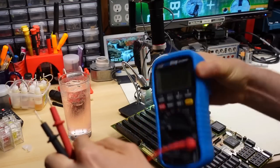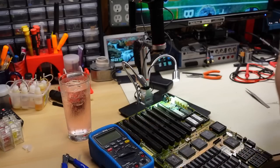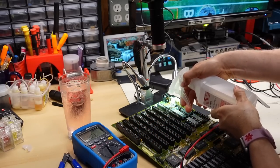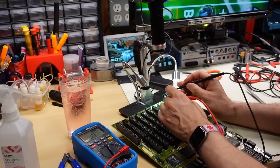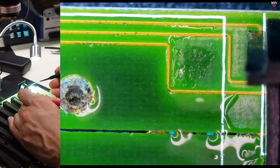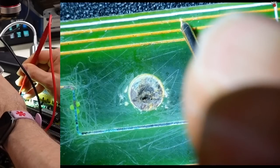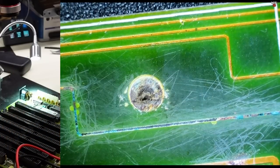I think it's time to break out the multimeter and start figuring out which traces are actually bad. I'm going to stick on the super pointy sharp leads — I've jabbed myself plenty of times with them. I'm going to grab the 99% IPA and spray it on this area here, because it just cleaned away some of that crust from scratching, making it a little bit easier to see. Let's check out these traces right up along the top and just poke into them to see if they have continuity. The solder mask does not like to be poked through.